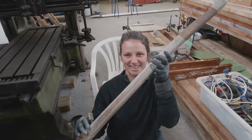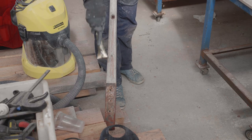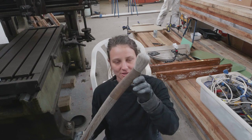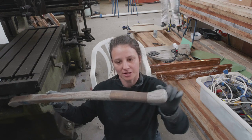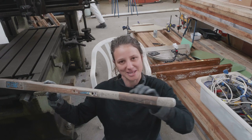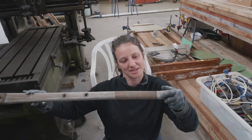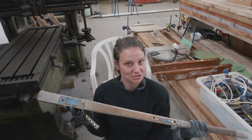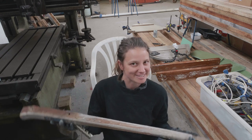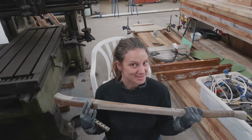Here's our tiller. The wood is pretty rotten on the outside so I'm scraping it back and going to give it a sand. I took the whipping off that Troy put on the handle with some cord, and the wood is actually quite raised from it — pretty trippy, I'd never seen that before. Anyway, we're going to sand this all back, then put a coat of epoxy on, and then decide whether to paint it or varnish it. I'd like to varnish it but it's a little bit more maintenance, so we'll see.